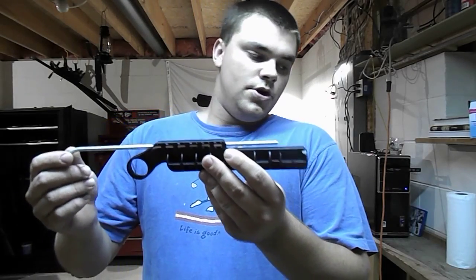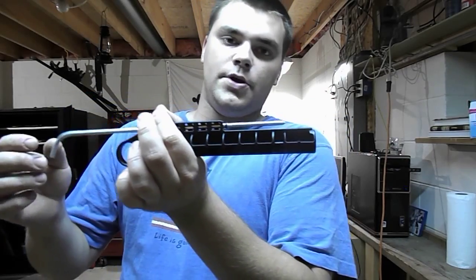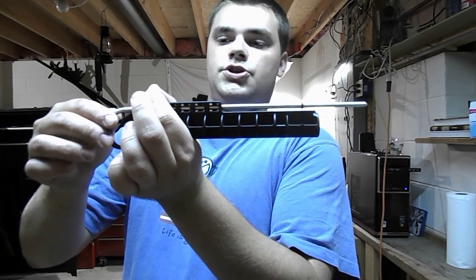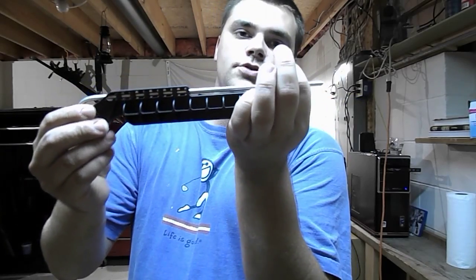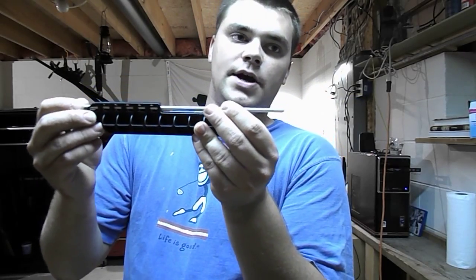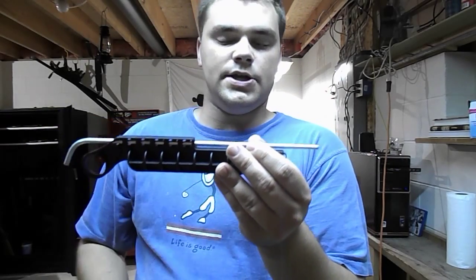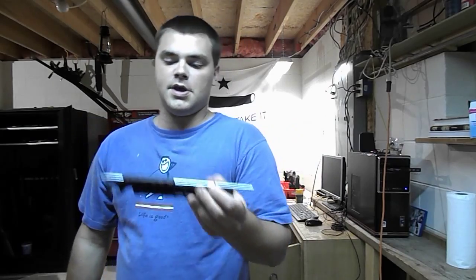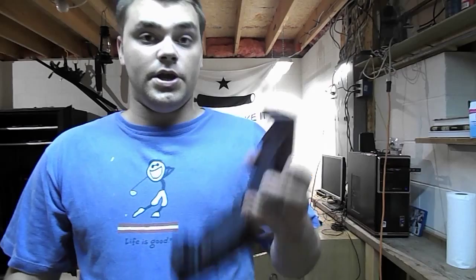What this is used for: you slide this into the upper, and when you're tightening up your barrel nut, you push this through the gas tube hole, and that'll make sure your barrel nut is lined up right so your gas tube will go right through the upper like it's supposed to without any issues. You can get by without this, but I'd say you'd be pretty hard-pressed to get by without some kind of a vise block to torque the barrel nut.